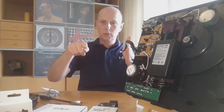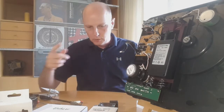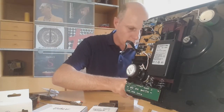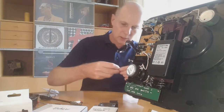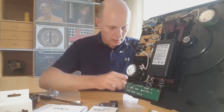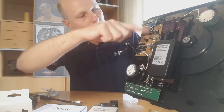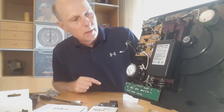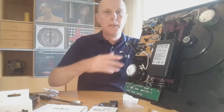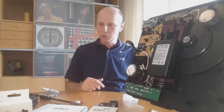You cut the signal wire, go to the preamp, go back and then continue. To do this you also have to remove two capacitors from the board. This is where you remove them and where you put in the wires. As soon as you do that, you amplify the signal and you get much more sound from your speaker.